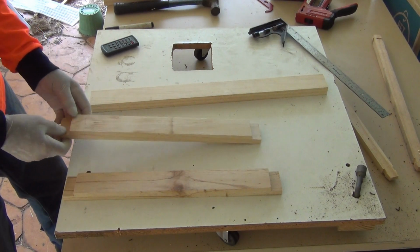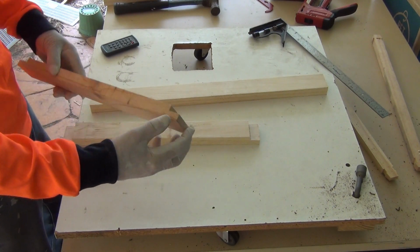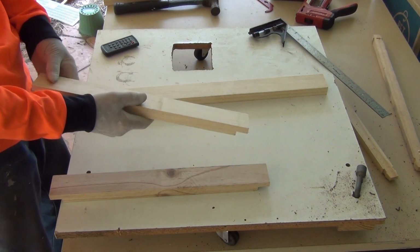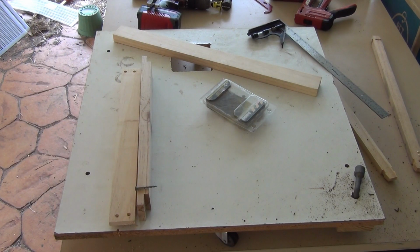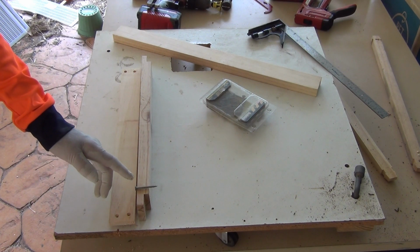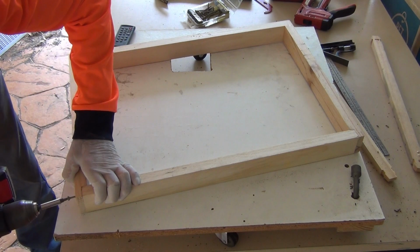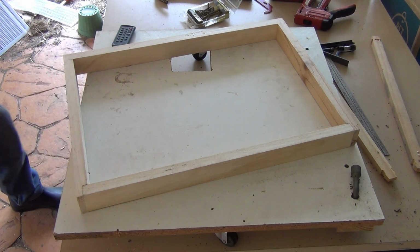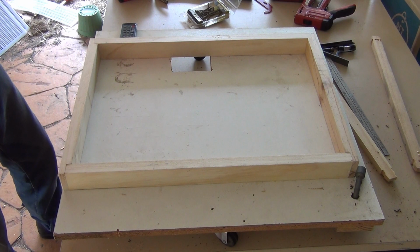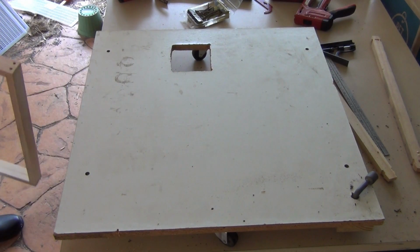On the short rails, you need to pre-drill and countersink the pilot holes at each end. With the pilot holes drilled, a 45mm by 8 gauge screw will be big enough. Put it to one side and bring up your board again.